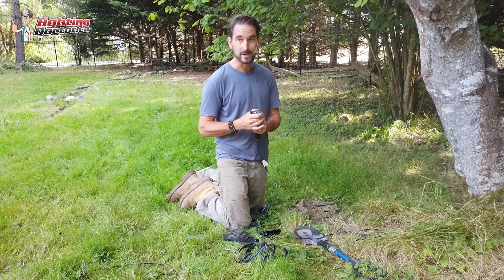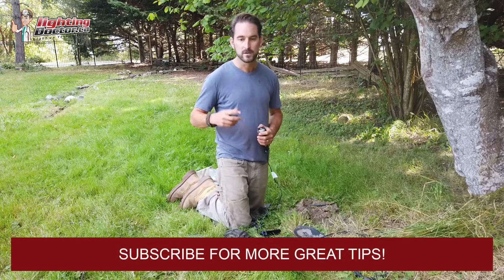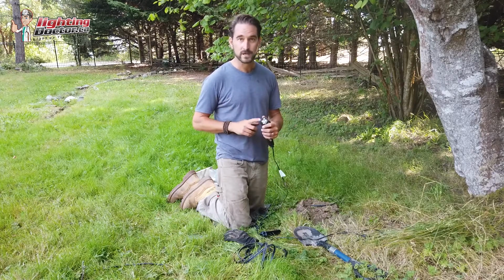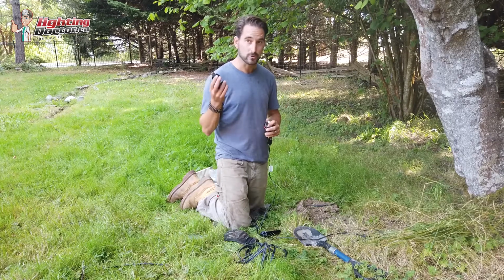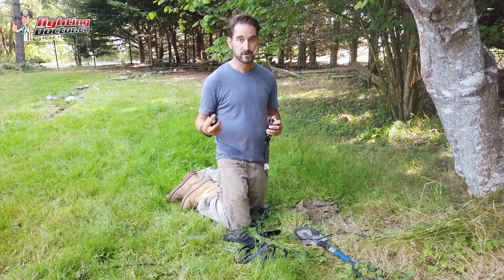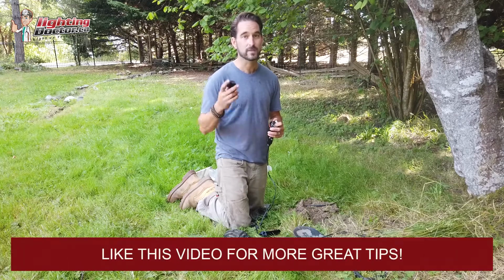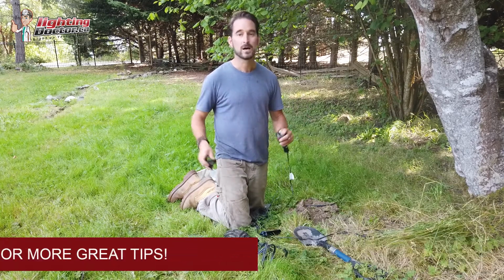A really good light. And then the other reason I like it, especially for a lot of do-it-yourselfers, and I get flak from professional lighting designers all the time saying, oh, integrated is the way to go. Personally, I still like this. I like getting a good quality fixture, and I like getting a good quality bulb. Again, you get some of the cheaper stuff you find online, and you're going to have problems with the bulb. They just don't last as long. They draw more power than they say, so that's where people run into voltage drops.